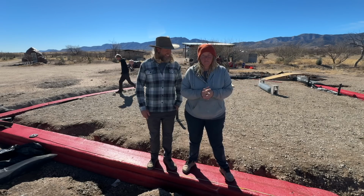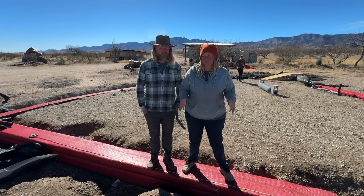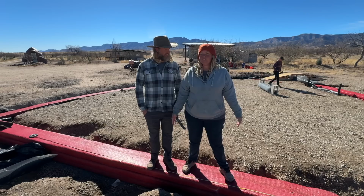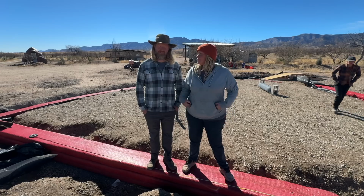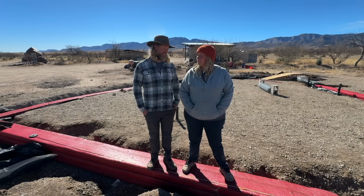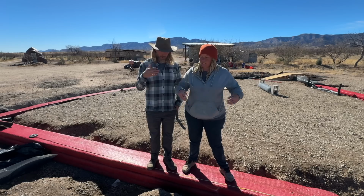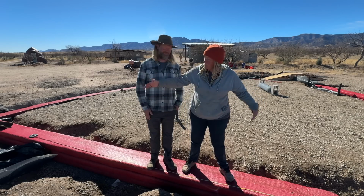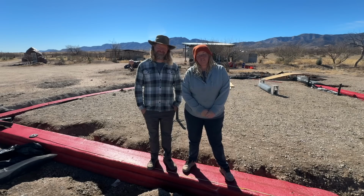We do suggest to everybody that's building like this to have a buttress every 10 to 12 feet. Yes. This wall from corner to corner is 13. We're gonna call it good. We're fine. Everything's fine. We were stressing out about it, and then when we realized it was actually 13 feet, we're like, that's close enough. That's gonna be okay. Especially the way we're building with the AB mix and how we're tamping, interlocked with 3 walls, so I feel like we're good. Everything's fine. Guys, just because your foot is called a foot doesn't mean it's a foot.